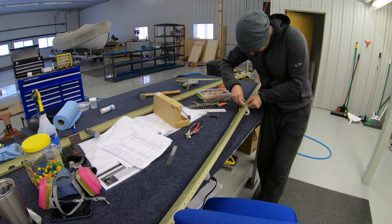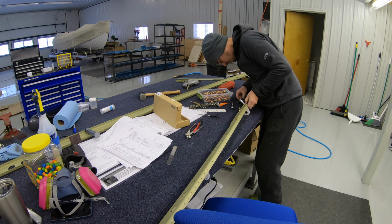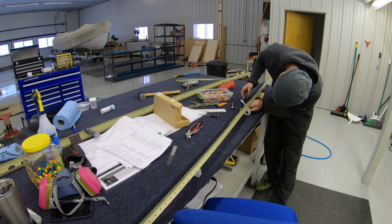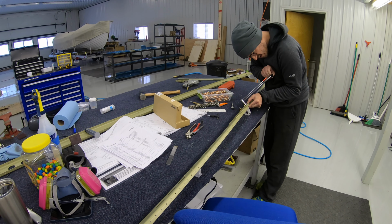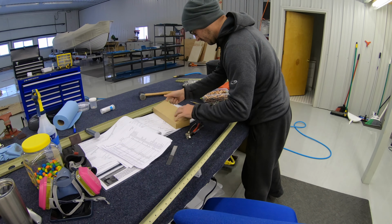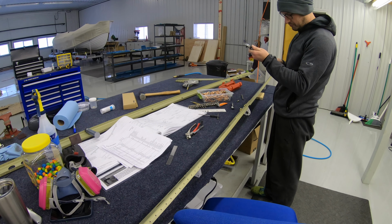That middle bracket with the captive bearing in it doesn't get riveted on, it gets bolted in place. So I first start with my beam and get the running torque and add that to the final torque on the click wrench.